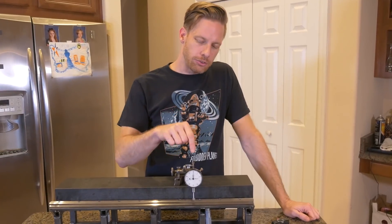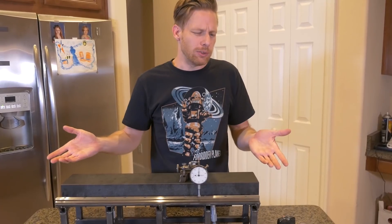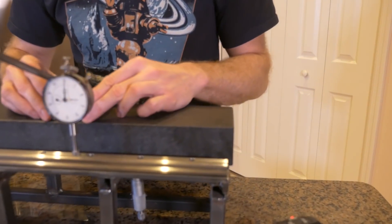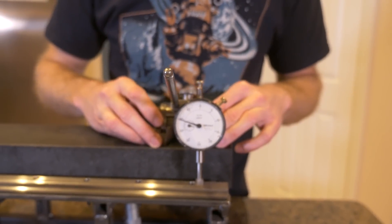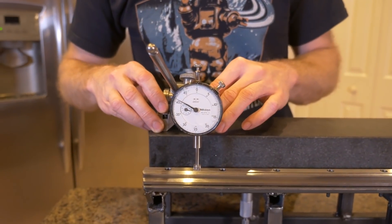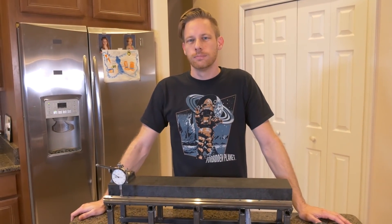I think this is our high point — I've set it to about zero. It's going to warp a little bit because we welded this, so it's not going to be perfect. Let's take a little measurement across the whole thing and see how far out we really are. That looks like about minus 10. Let's take a good map of that — the same way we did the bedways before.